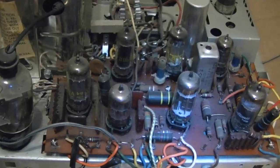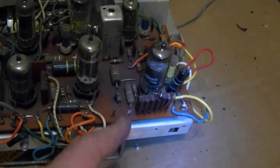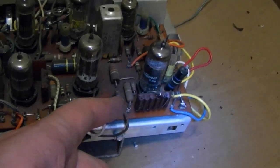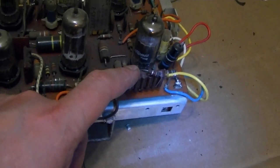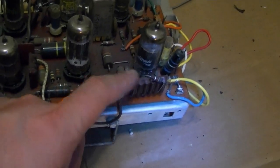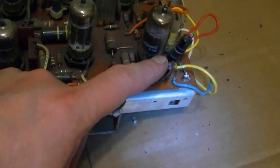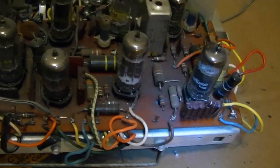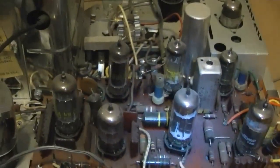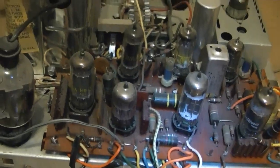Alright, so we've seen the top, and I don't see any repairs whatsoever. Huh, that's curious. If you recall, in the one I'm working on, or one of the ones I talked about, the tandem sets, there was a resistor across this network, and the part number on this K network wasn't quite right for this chassis. And I suspected it may have been done at the factory because they ran out of the right component. This one has that same modification to it, so now I'm convinced this was done at the factory. This resistor strapped in in parallel to one of the internal resistors. Looks like only maybe one or two of the tubes are original, so this set may have seen a bit of use. But again, not many repairs.